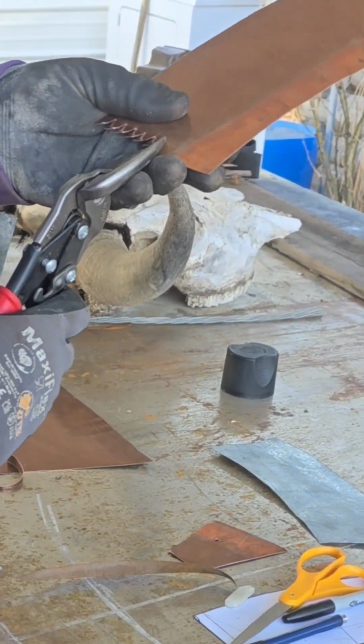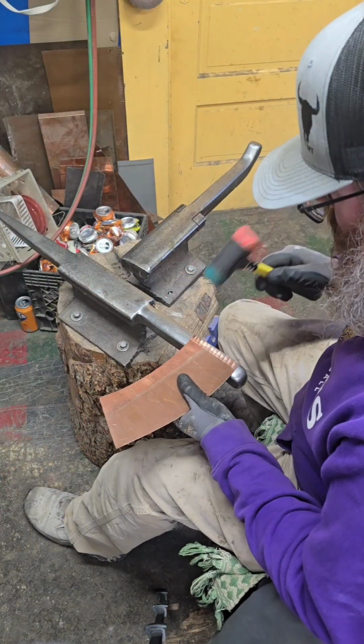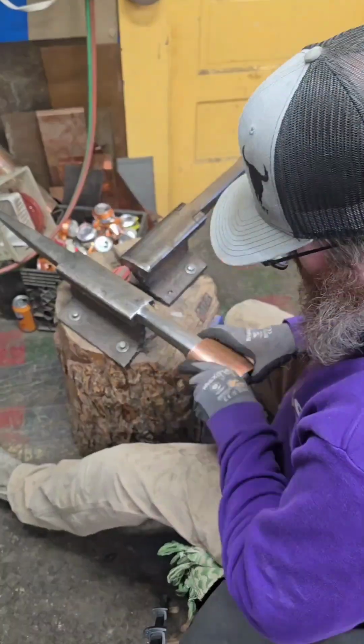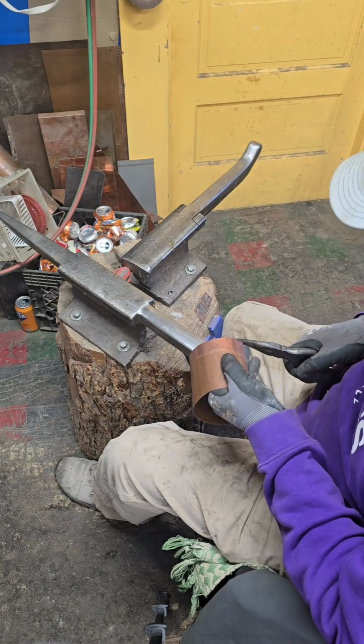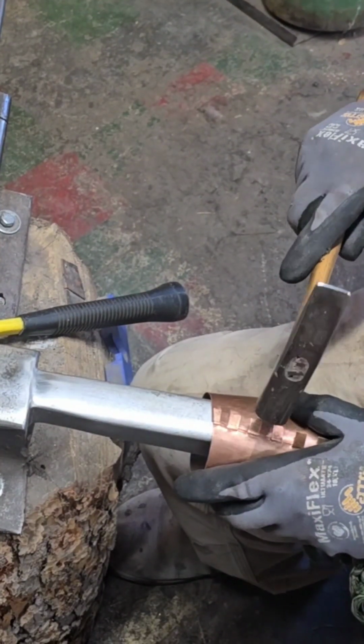So this is different than raising. I'm going to braze this cup together. So I'm going to start by forming the curve on the ends, and then I'll form the rest of the curve with my hands and make a cylinder. Here we're going to alternate the fingers and use the fingers to set the seam.